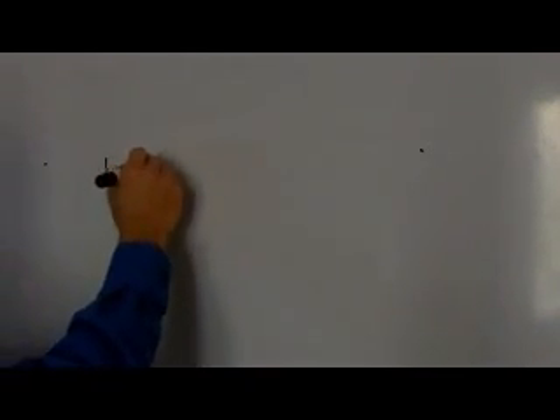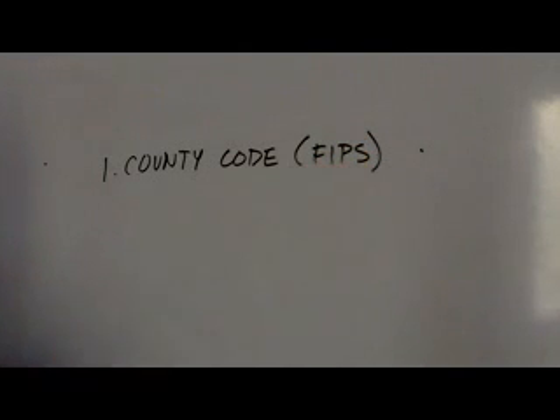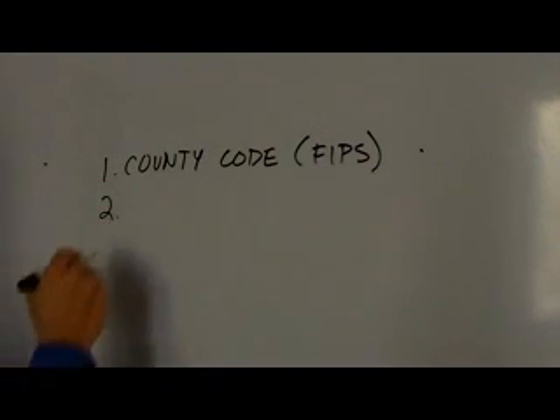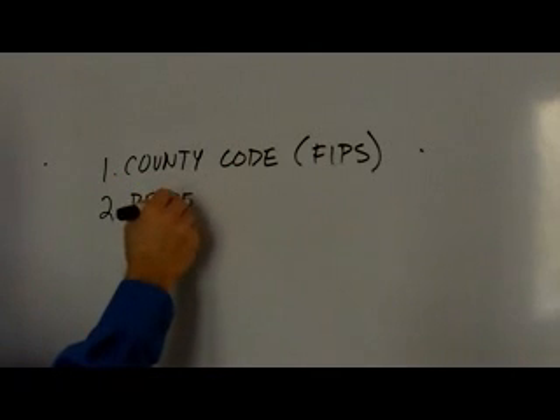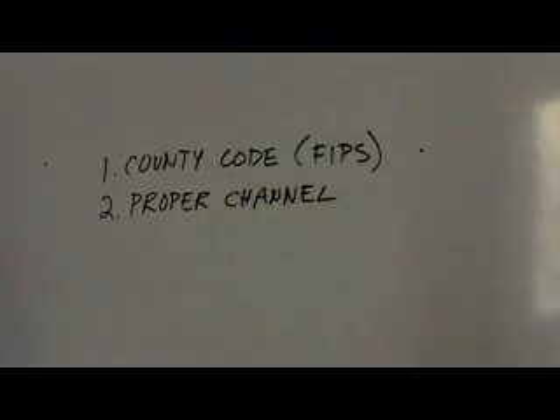The first step in making sure your radio is properly programmed: you need your county code. Each county in the United States has an individual code that we program into these radios so that the warnings for your county are what alarm the radios. You don't want your radio going off when warnings are for other counties, especially outside of your immediate area. It's also called a FIPS code. I have provided a link in the description of this video at my website, charlieneese.com. Click on that link and follow the menu until you find your county, and you'll be able to program that six-digit code into the radio. Also make sure your radio is programmed to the proper channel or frequency to hear broadcasts from the National Weather Service. If your radio is not tuned to the proper channel, you might miss the warnings even if you do have the proper codes.